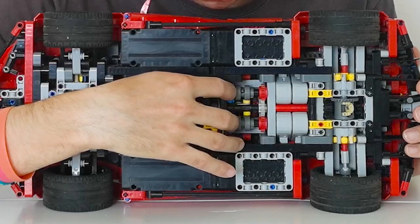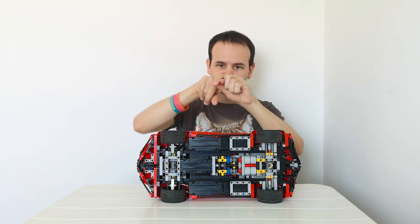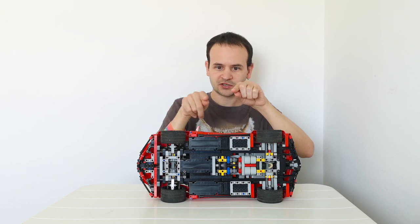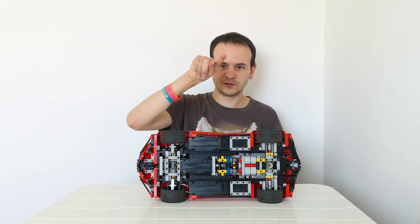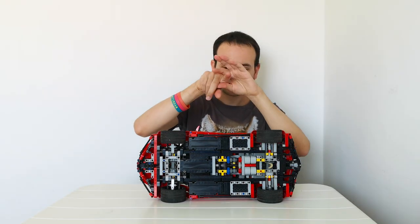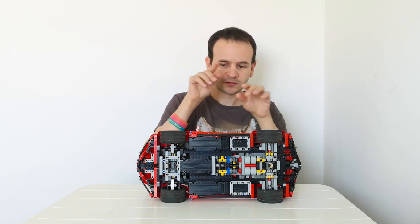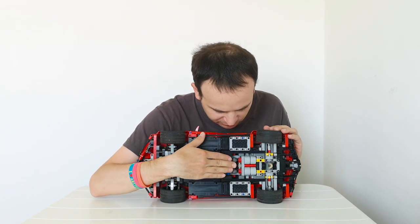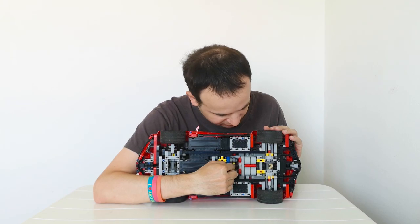The advantage of using this setup is that the gears are both driving one central axle. And if you imagine this is the central gear, this side is pushing it down, while this side, which is also spinning in the same direction, is pushing it up. Which means that the central axle has no side forces to deal with. So there are no side forces pushing the axle into the bearing or pushing it the other direction. Which means there is no problem with the axle melting or things like that. So the central axle only has to deal with torque. This gives this kind of setup a really good efficiency and very good, let's say, lifetime, because there are no side forces on the main drive axle.